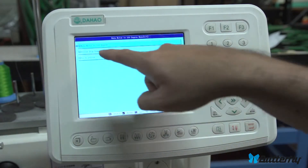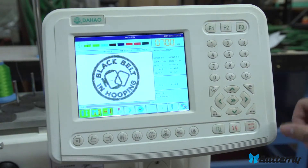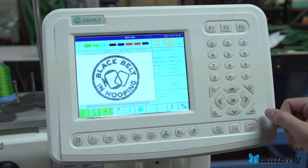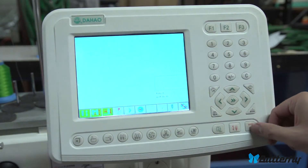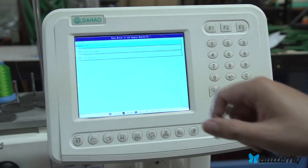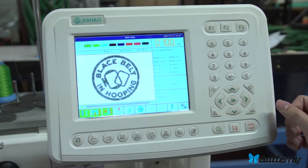So if you press this button here — this dot here — you can see 'move the main motor to 100 degrees.' If I press that and press enter, it just spins the main shaft and brings it back to the home position or 100 degrees. This is pretty important if you are a technician. If for some reason your main motor is not at 100 degrees and it's complaining, press the dot, select 'main motor 100 degrees,' press enter, and there we go.